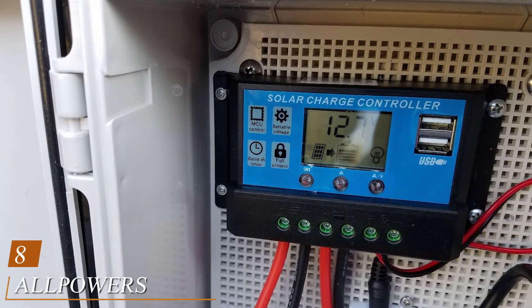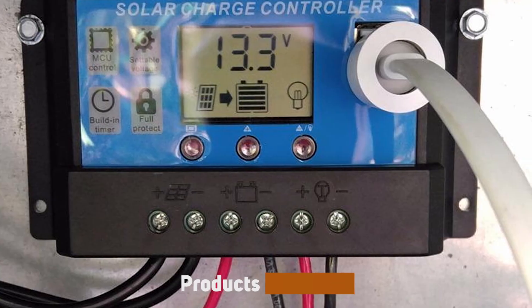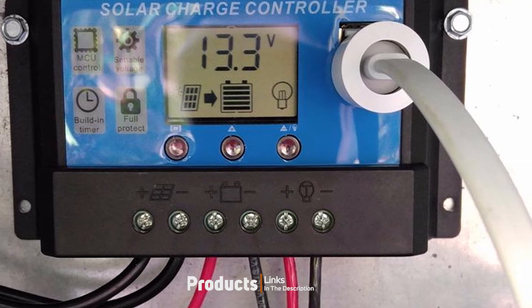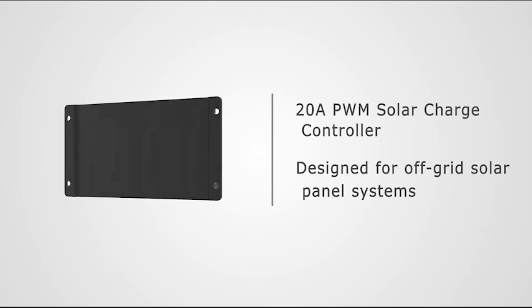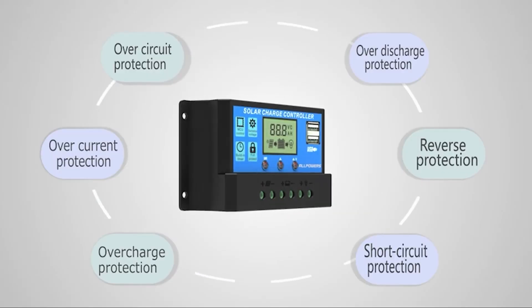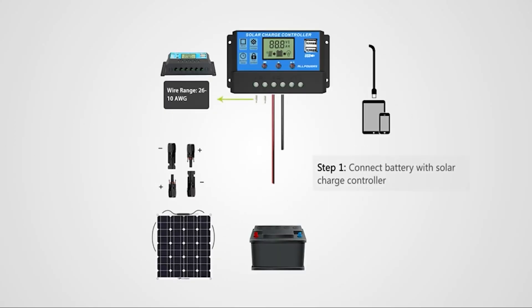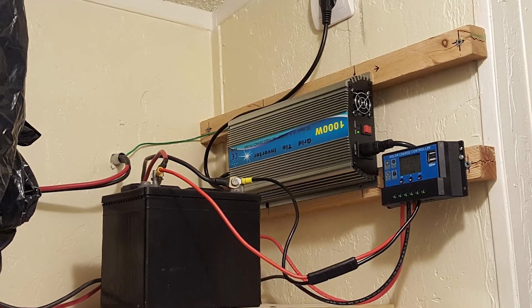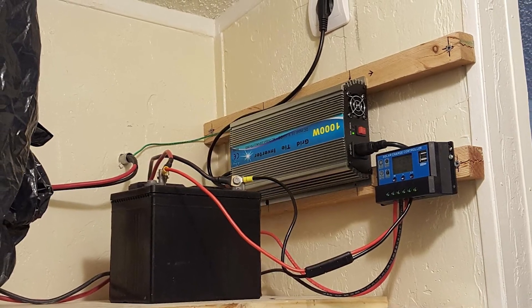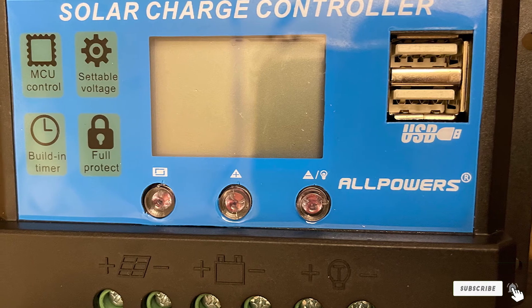The number 8 position is held by the All Powers 20A Solar Charger. This solar battery charge controller from All Powers 20A is a good quality, low-priced product that any solar enthusiast should take into account. The All Powers controller is a lead-acid battery charger capable of handling flooded, AGM, or GEL cells. It is intended for indoor use and is able to work within a temperature range of -35°C to +60°C, while counting with multiple electric circuit protection features. The adjustable power rate with dual USB 5V/3A ports offers a great option for phone charging or home applications. Equipped with an industrial-grade STM8 microprocessor, the three-stage bulk, absorption, and float charge management and four-stage PWM charge of the battery assures its protection and lifespan.